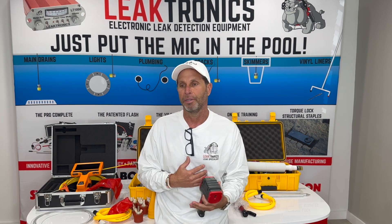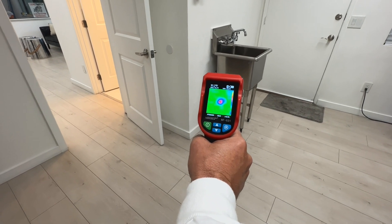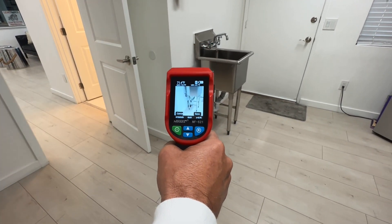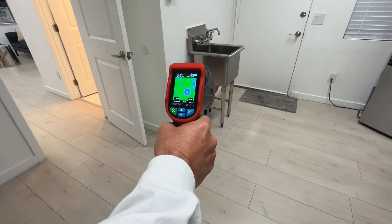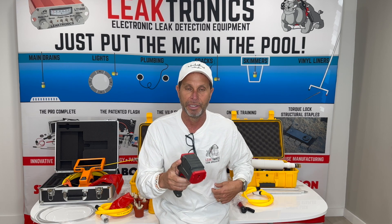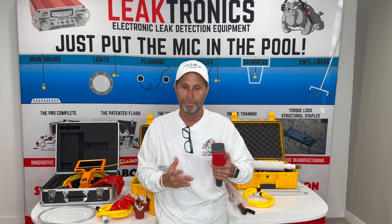At that point, we would typically use our leak stick and deck plate and hover in. When you're in a location and you see something popping up on your screen as a hotspot, press the trigger. That's going to take a photo of that area — not just of the hotspot — which stores it on the memory card. If you're generating a leak detection report and want to include that, just take the mini SD card out and upload it. You can include those pics with your reports to back yourself up and produce your findings.